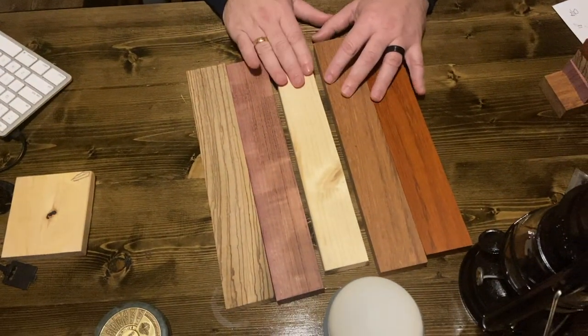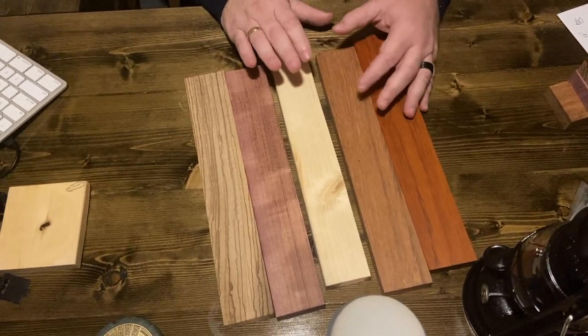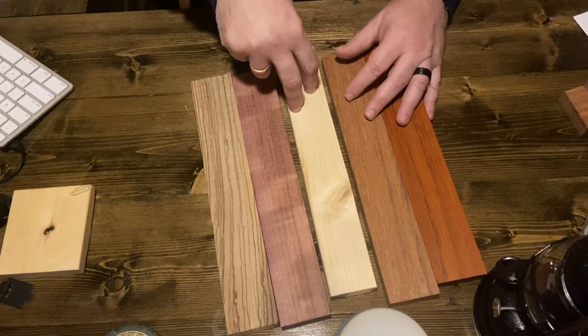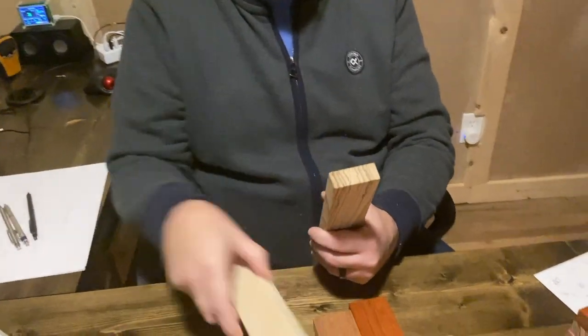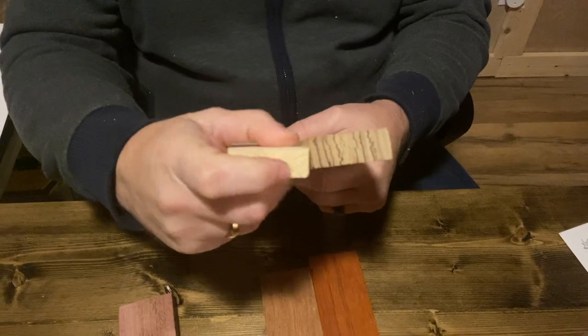Generally, we don't make mistakes — on occasion we'll miscalculate the amount we need. Stay with softwood: it's cheaper, it works easier, and your equipment will last longer — I mean blades primarily. The hardwoods are also very tough on your motors. There are advantages in hardwoods: you can make much better connections because the grain is much tighter. If I place a screw here in the hardwood, I have a better connection than in the softwood.